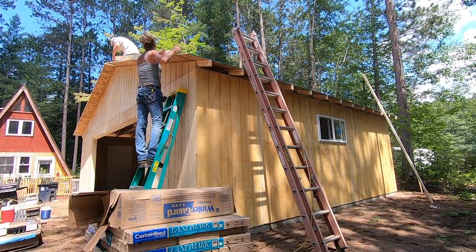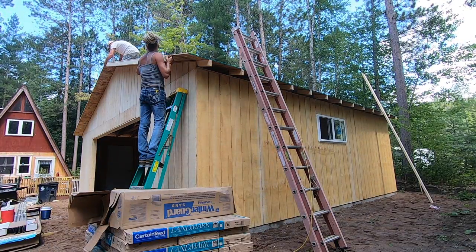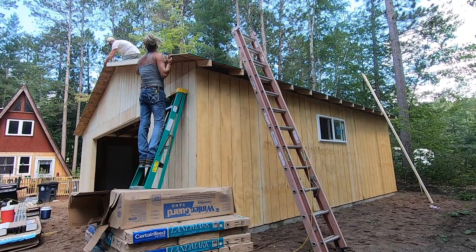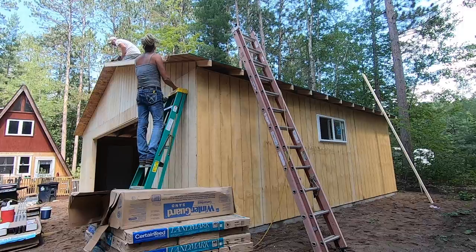After the roof is sheeted, we hang the fly rafters and the subfascia. This company uses 1x6 for subfascia. A lot of other places will use 2x6, but either case, it will get covered by aluminum soffit and fascia.